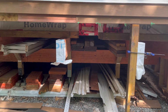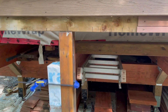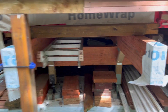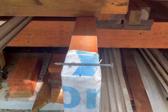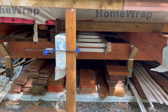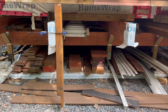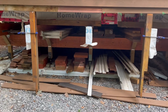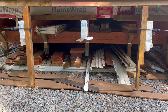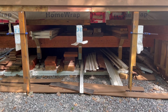I'm going through the thinking process of how I was going to do my two gates, and I think I got a plan. I think I'll be screwing some sort of 4x4 — something similar to this. I know I have the old green ones also underneath the deck that I can pull out. I'll be using these screws to screw them to my LVL, and that'll be a good base to hang my gate to. So I'll have two gates of above 36.5 wide by 51-52 inches high. That LVL in the middle will kind of act as my stopper. We're getting there.